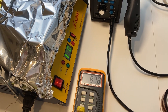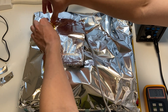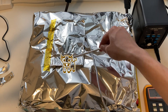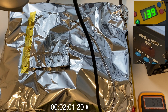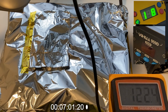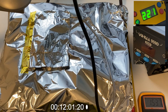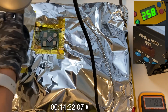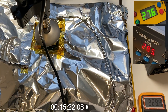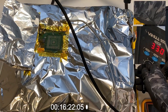They are all cheap and made in China. Let's cover up this gigantic hole — it's important because the temperature near the RSX drops a lot without it. When I open it, the temperature crashes; when I close it, it goes to the moon. Stage 1: target temperature 140, then 160 and 180. The board is still well below 180, so we need to increase the preheating temperature even more. Our goal is to make the board temperature 180. Target temperature arrived. Apply even more flux and blow some hot air. We want to heat up the RSX to 250. Nudge it from time to time to see if it moves. It moves — time to extract it. Extraction successful.